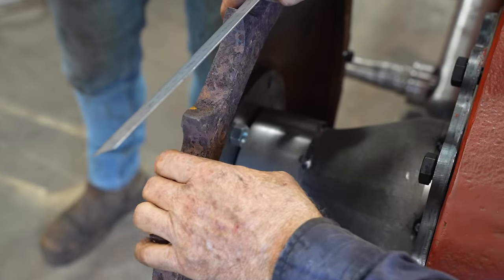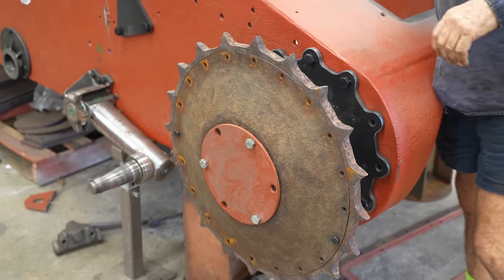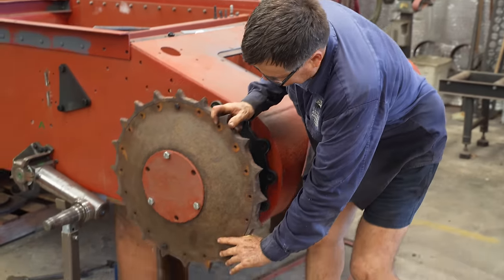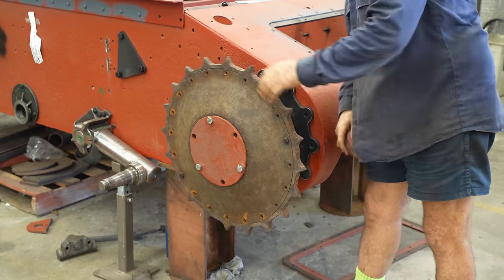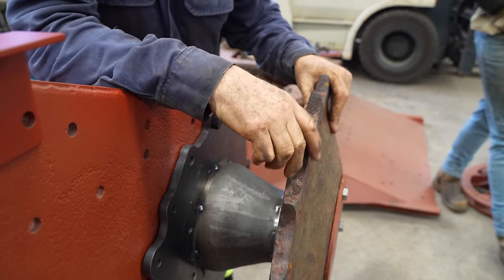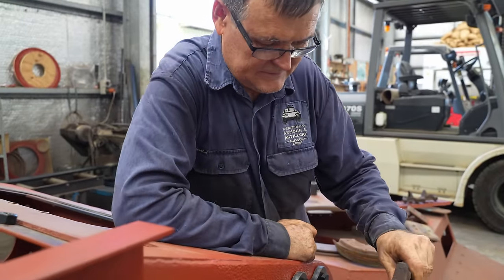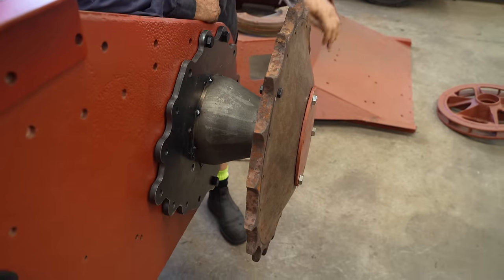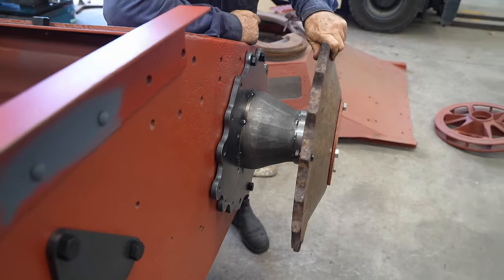Just put it on temporary, so that goes like that. We've only put the minimal heat in here — once it's fully welded everything it will shrink slightly. Still, I have to be happy with that. In fact it turns — I'm happy. And it spins true. It turns out after tightening a few bolts, the sprocket was only about one or two millimetres out.